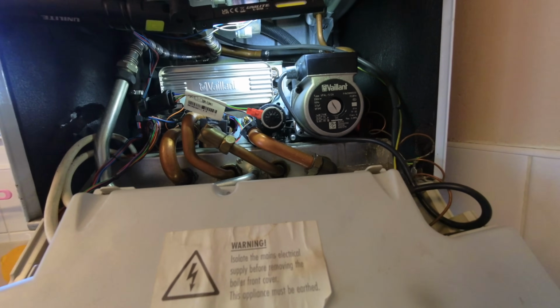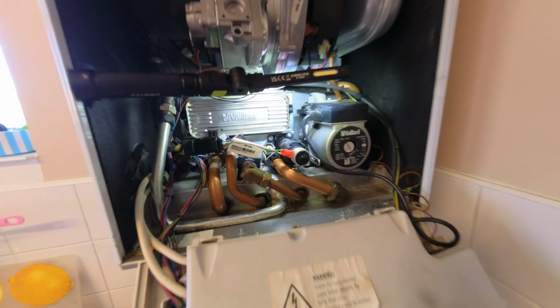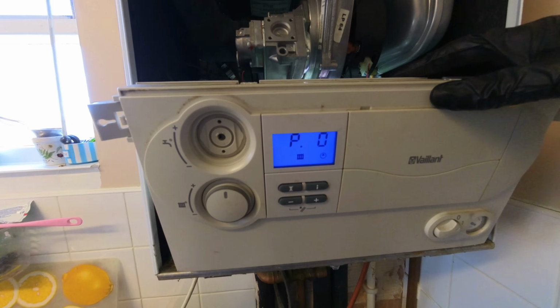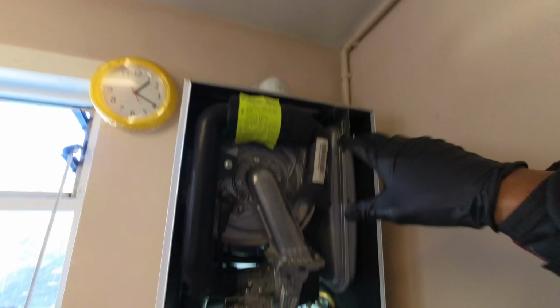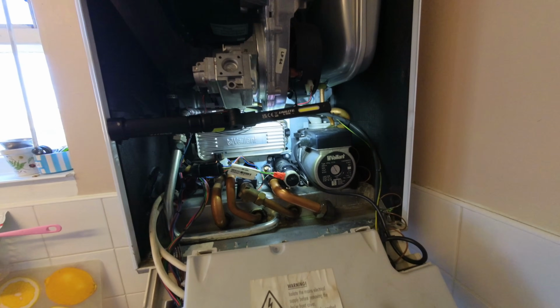Right, phase one complete. So new diverter body and reuse the old motor because there's nothing wrong with that. So we'll back up the pressure, just purging that, getting all the air out of it. Whilst that's purging, I'm gonna do the turret seal in the meantime because that can be doing its thing. It's not gonna affect me doing that. So I'll crack on with that next.